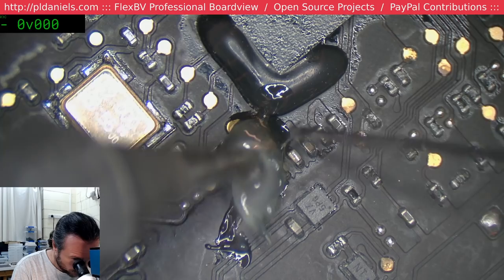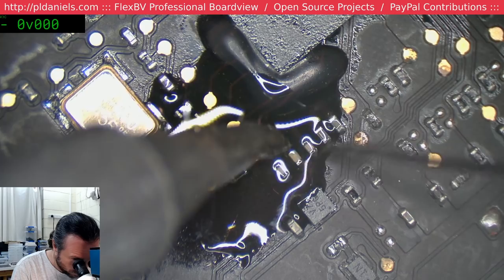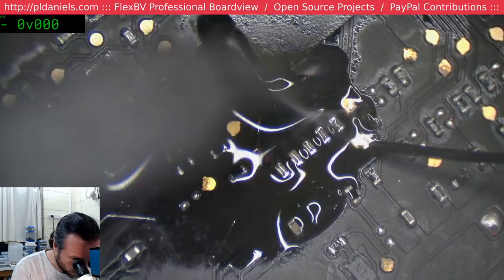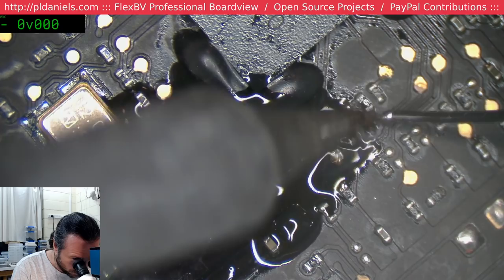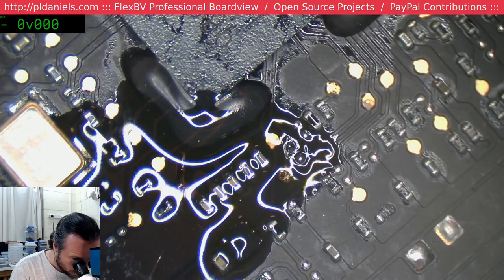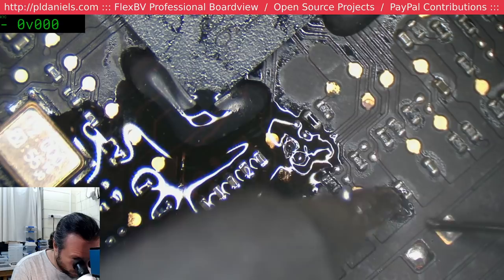Oh, that cap's a goner too, right there. We'll just saw at these a little bit, see who comes alive and who doesn't. Alright, that resistor is also borderline. Yep. You're out of here. You moved. You are gone. If they move when you solder way into the cap, then you gotta take them off, because it means something's wrong with them. Either the end cap of the part itself has broken free of the inner component, or the pad holding it has got issues.